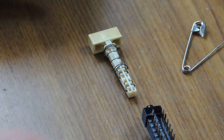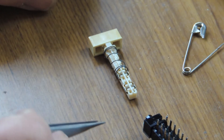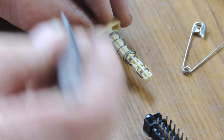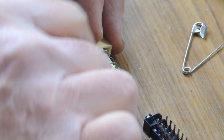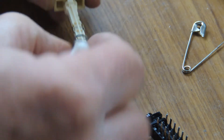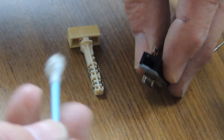Two separate parts now, and you can see there are four contacts which obviously slide inside there. The moisture you can see was from a previous application of switch cleaner which did nothing. Using a fresh cotton bud, wipe those carefully. There are tiny little springs — those are what put the spring pressure on the contacts when it slides in and out. Give those a very careful wipe. Be careful as they can spring and go anywhere, and they are tiny. If you can withdraw the spring carefully, but I'd leave those assembled and just very carefully wipe the contacts.